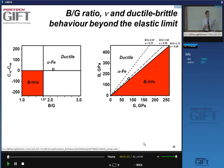in strength properties, and in particular, you can't really test in tension by yourself. Even if it's only a megapascal, a piece of paper, you would have a hard time ripping it apart in tension. But you can have an idea of the strength by just ripping it. Paper is easy to rip, steel's lots harder to rip. It's related, and when you bend, it's more related to what we call elastic collapse. But it gives you an idea of the kind of strength.